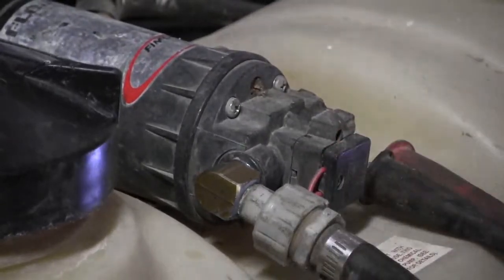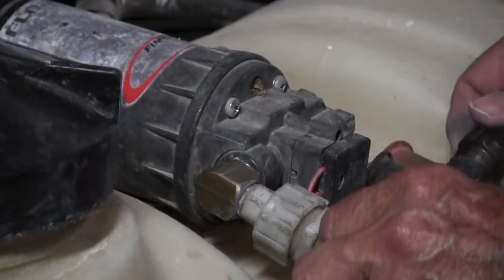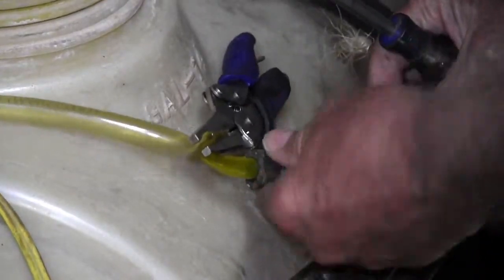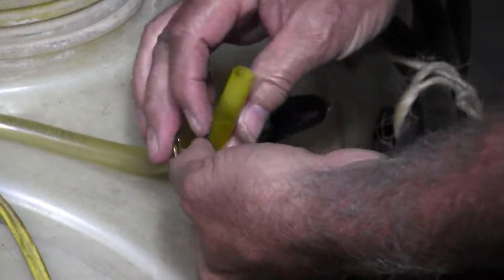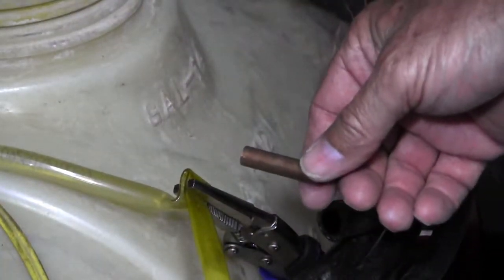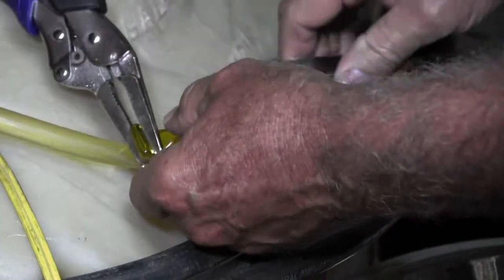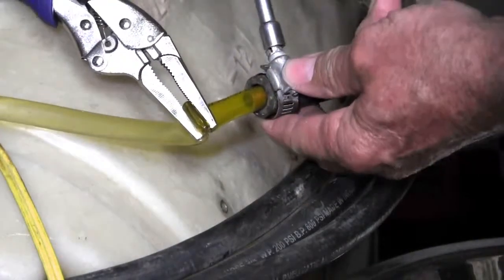Okay, that's snug. Connection on here is good. There is no insert here — this is soft. The clamp just squeezes a piece of rigid copper for an insert. Slip that in here and in the hose — the clamp won't be able to squeeze it, it'll hold solid.